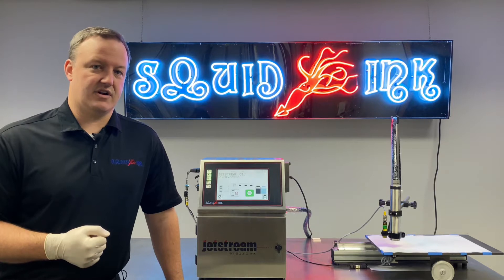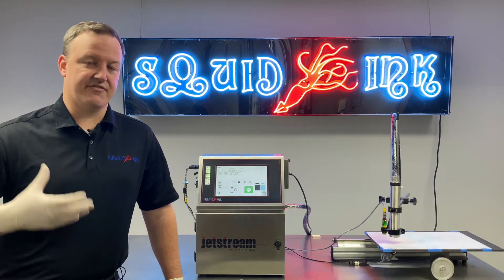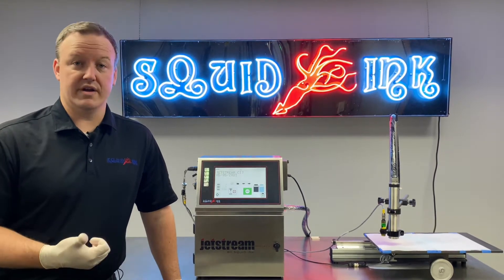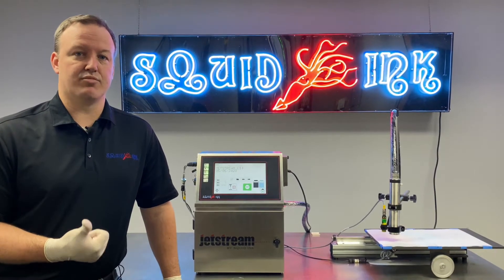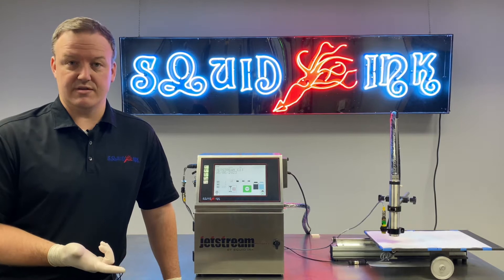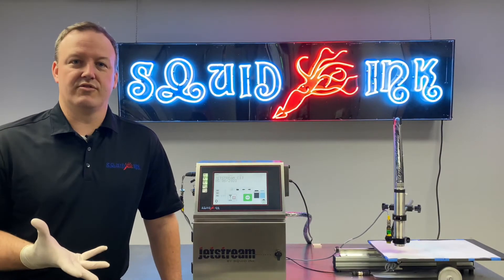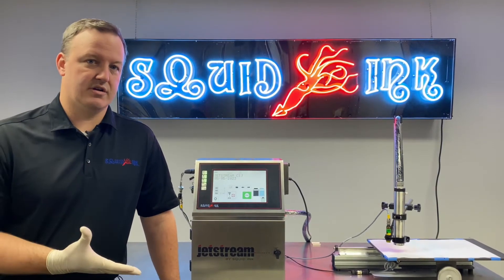The other precondition variable that we need to verify is pressure. Our internal pressure needs to be stable. If we're seeing significant fluctuations in pressure, make sure you watch our video on troubleshooting the pressure pump and pressure transducer. A couple other items we need to verify: one is the printhead — are all of our critical printhead components clean? If they're not, make sure you watch our video on proper cleaning of the printhead. Another variable we need to verify is whether or not the ink stream is aligned properly. If it's not, you're going to want to watch our video on back flushing the nozzle and also possibly our video on manually realigning the jet. If all of those precondition variables are verified as correct or stable, we can then calibrate our modulation value.